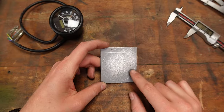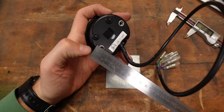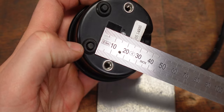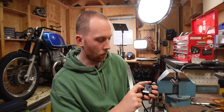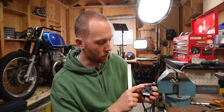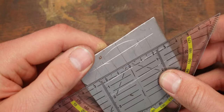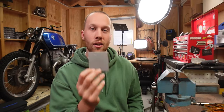Then you transfer that measurement onto one of the center lines — that's going to be your horizontal reference line. From there, take the ruler and measure from the center of the hole up to the outer ring of the button. I drew a parallel line to the center line 11 millimeters up, so that gives us the bottom part of the cutout. We just need the top part, and you get that by measuring the size of the buttons, adding that to the line you've already drawn. That's how you hopefully get the right measurements — we'll see in a second if that worked, but this would have helped me so much. Fortunately, I've learned a thing or two, even though it's basic stuff like this.